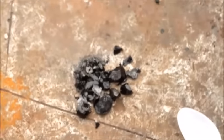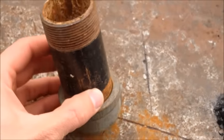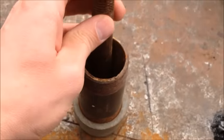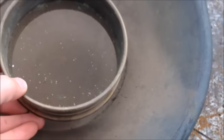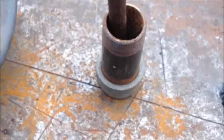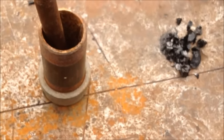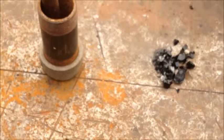So what we're going to do is take all of our slag. This is one of the first rock crushing things I ever made — it's just a pipe nipple and a pipe cap with a long bolt. We're going to put our slag down in there and crush it. I have a 20-mesh screen and we're going to screen it into the gold pan. Anything larger than 20 mesh goes back in to be crushed again. Then I'm going to pick out all the little gold BBs and melt it all down with an oxy-acetylene torch into one single button so we can get it weighed.